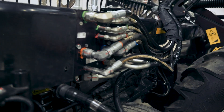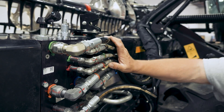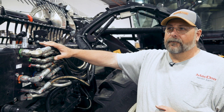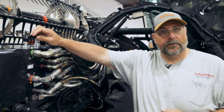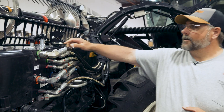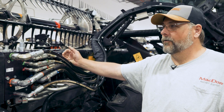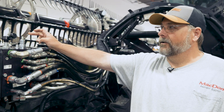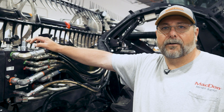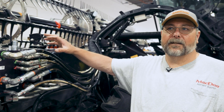Following our hoses along, we connect here to our new header-mounted manifold — exactly the same as on the FD2 series. This is the connection point for all of your hydraulics between the header and the windrower or combine, and also the location for a lot of your accessory control valves. This header has an upper cross auger on-off switch so you don't have to run the auger if you don't want to. This component is the relief valve for your VertiBlade. The VertiBlade system works on the reel return circuit — oil returns to this location and approximately two gallons of oil is siphoned off to run the VertiBlade. It has a built-in relief valve so if your VertiBlades were to stall, it would not affect the function of the reel. It's a fully integrated system, designed as part of the header, not an accessory add-on.